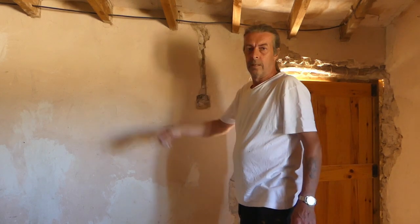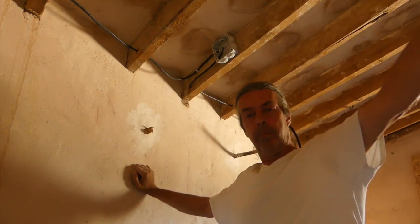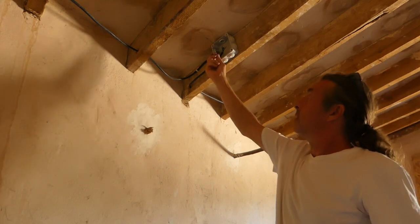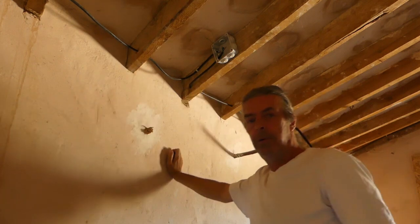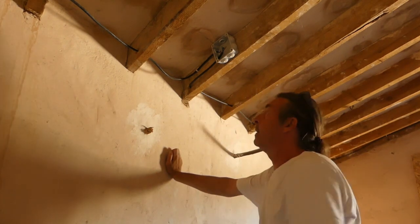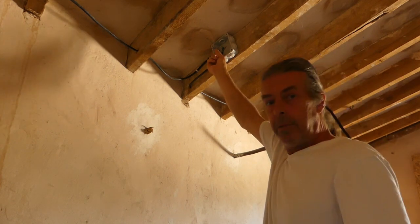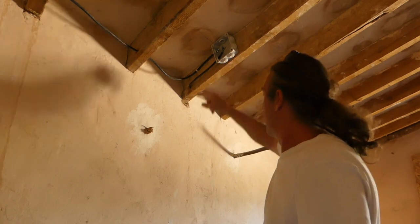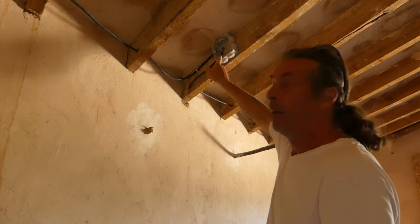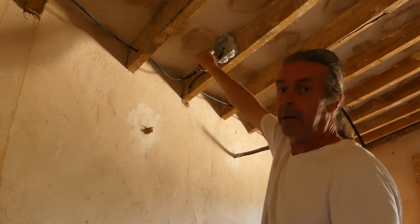I think we'll do the light over the seating area first. I'll try and explain this. The wire from the previous thing, from the supply, comes in here. It then needs to lead off to the next light. So the neutral, positive and earth in here need to be joined together to keep the power going that way. With the connectors, we put a connector on each of these, and then from the live, another connector which will then run down to my switch that I've just cut. When that switch becomes live, it will come back into here again. And then the two lights will be fed off that — one there, one there. The neutrals from there will then go back into the neutral block.